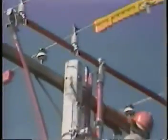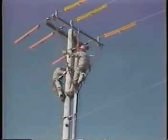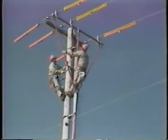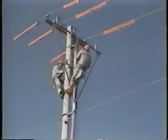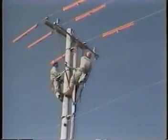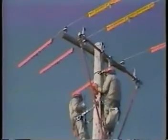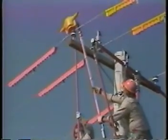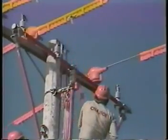Replace the cross arm guard and pole covers as needed to tie in the other two phases. Loosen the top saddle and raise the auxiliary arm so you can open the latches with a tie stick. Now, lower the auxiliary arm until it rests on the top saddle. Remove the cross arm guard and pole covers. Put on the three insulator covers and move the conductor covers back into place.